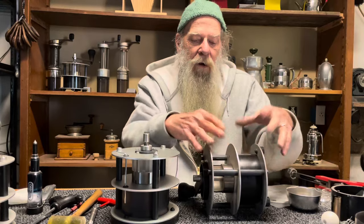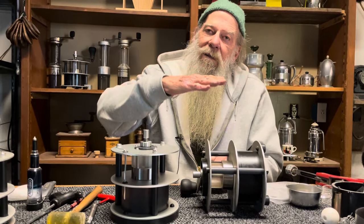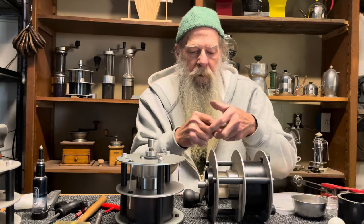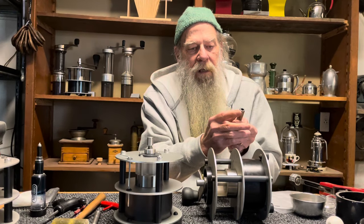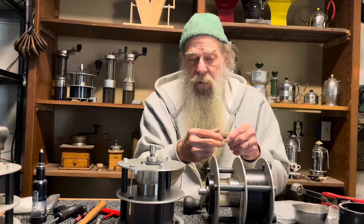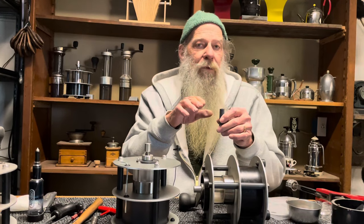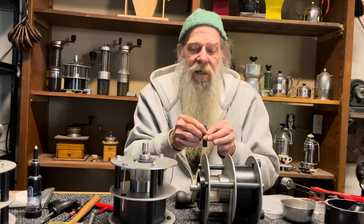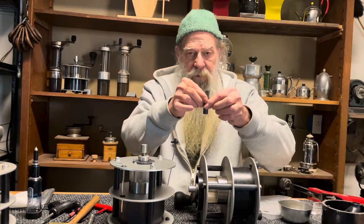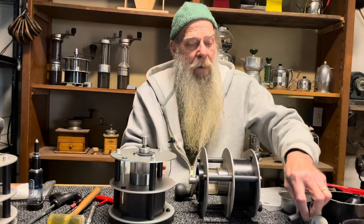These bolt covers — these are all critical components. These three plates have to be parallel to one another, or else the burr is going to be completely off. These plastic covers we made with this — the original little jig. We would take a regular tubing cutter and cut them off at that line. If they were a little too short, that was a problem. We would line them up and find the ones that were too short and ones that were a little longer — not a very precise thing. So to make them a precise length, we had a flatbed knife sharpener. And Barb would sit there and, if they were too long, she would measure, sand, measure, until they were correct.